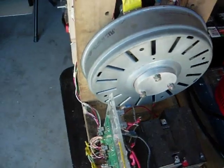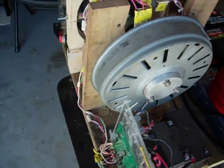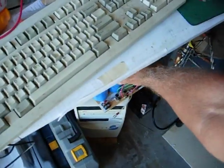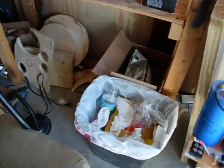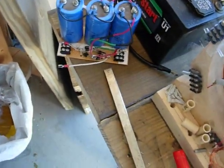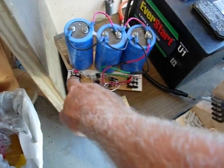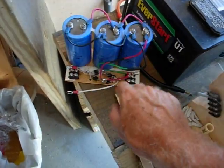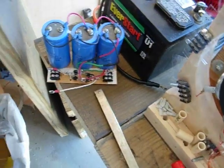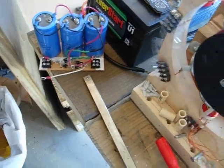I made a power supply here — I'll show you that in a second. This power supply is simply AC coming in this side, bridge rectifier, some caps, and DC out over here on this side, going to the 160 on the board.